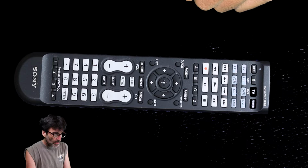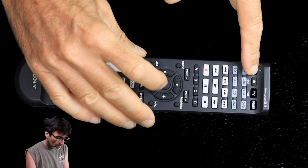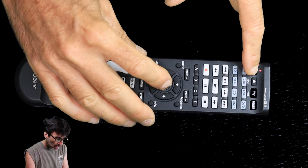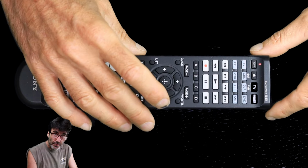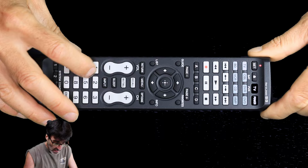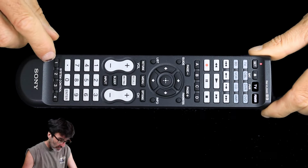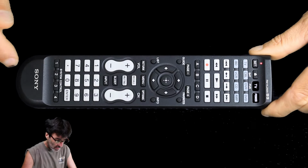So to do this, you'll start out as usual, press the set button until the LED comes on, and then press the select button, and then release both buttons. And I'm only calling it a select button, but for lack of a better term. Okay, so enter 9, 8, 1, and then you're going to press one of the system control buttons. I'm going to use button number 1.